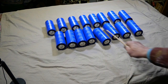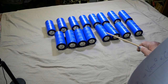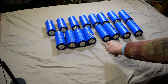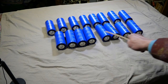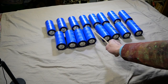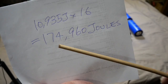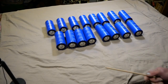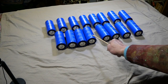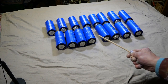So when he uses four pieces of capacitor, he will end up with about 44,000 joules. But when I do these 16 capacitors together and form a 21.6 volt power supply, it's four times the energy storage — equal to 174,960 joules. No matter how you configure the capacitors, each capacitor has the same amount of energy storage in joules. It doesn't matter how you configure series or parallel — you still end up with the same amount of joule energy.